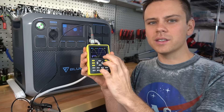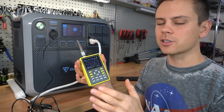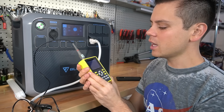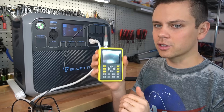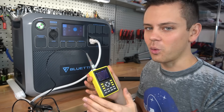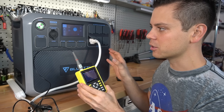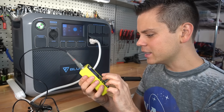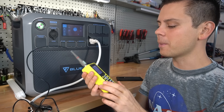The sine wave on this unit is really nice. I've been experimenting with a scope and going to all of my inverters to see what a good waveform looks like, and testing the grid even with inductive loads — so it's a pretty incredible inverter circuit. That doesn't mean everything else is going to work well; it just takes one part of these all-in-one systems to make them fail miserably. But the sine wave is very clean, and I'm pretty sure the total harmonic distortion is very, very low.